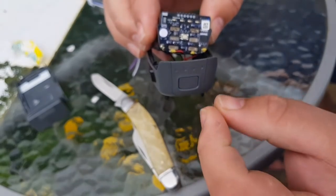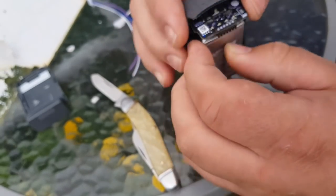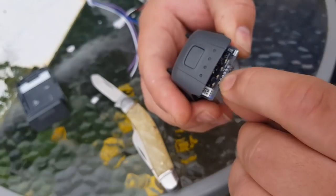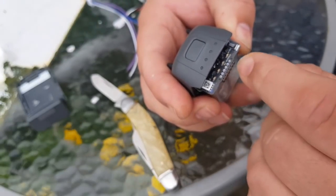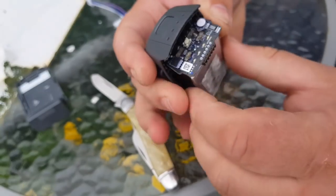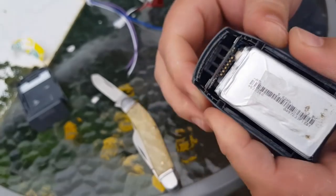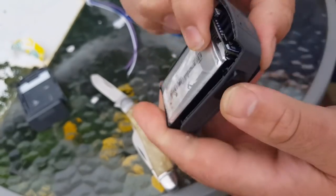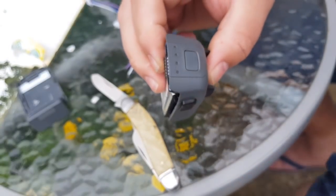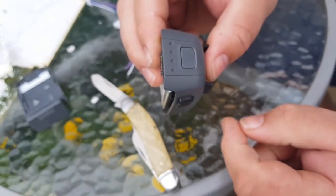So when you drill a hole, you put your wires through, solder them on, hot glue them, put it all back down. There's four LEDs here — you want to make sure that the wire goes between them. Your positive goes between them. Because if you don't, when you go to put your board back down, your LEDs won't line up with the little black rubber bit. So when you press your button, your lights will look like they're not lighting up but they are. Those lights lit up normally — because of the camera it shows like it's going in sequence, but it's actually not, so don't worry about that.